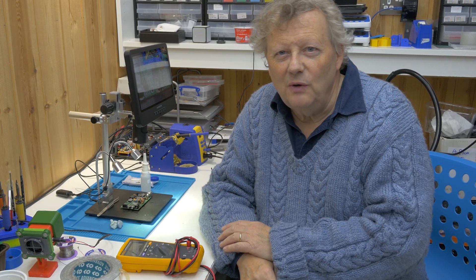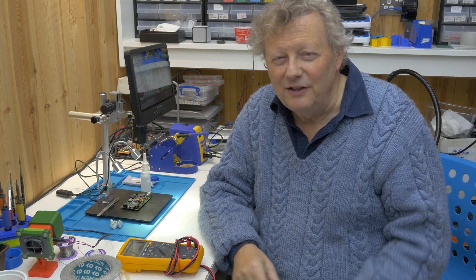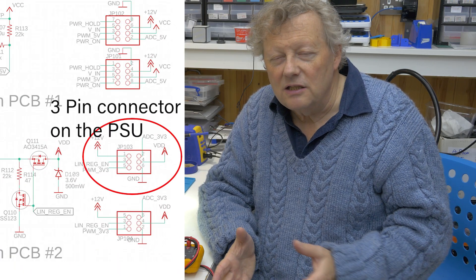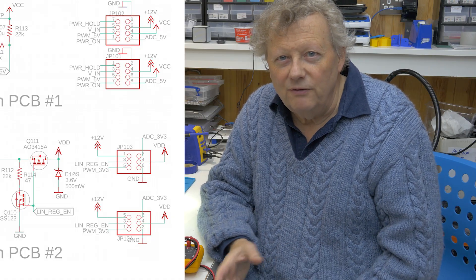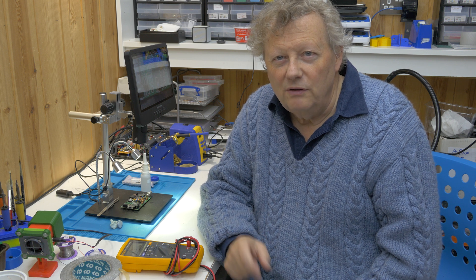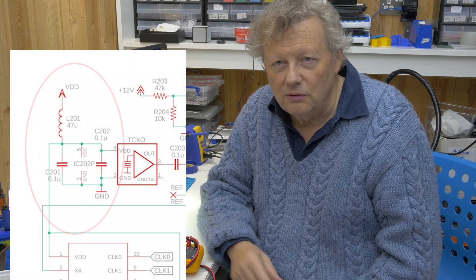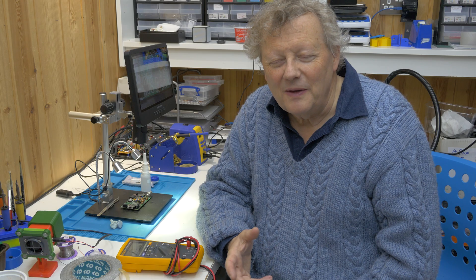So this is my second QMX on the bench because I haven't been able to get it to work. I started it up as suggested with a limited current power supply, which clearly suggested there was something wrong — probably a short. I investigated and found yes, there is a short on the VDD line. It's a bit tricky to deal with. I've looked at all the capacitors and everything else connected to ground in that line and removed an awful lot of them, but I still can't clear the fault.